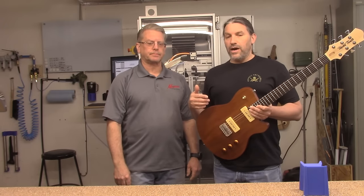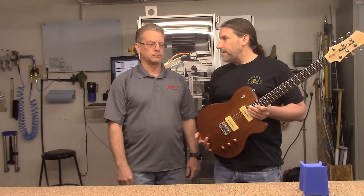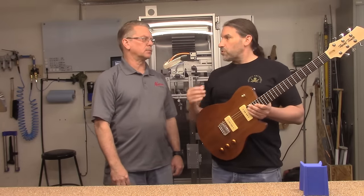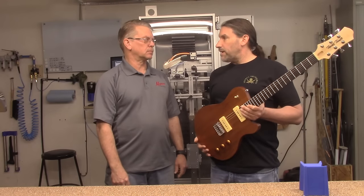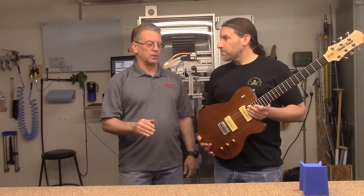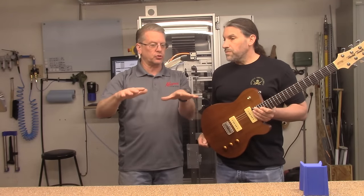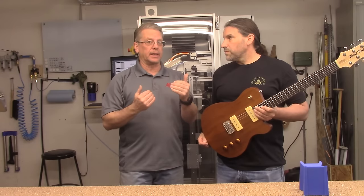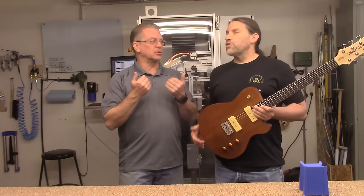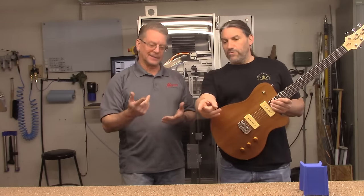But if you have a guitar neck that you want plecked, can someone just send you a neck and say, hey Steve, plek it for me? Or if Ike at Flipside Music, the great American guitar store, took a bunch of necks in there, how would that work? Yes and no. It is possible, but everything the PLEK machine does to the neck is done by calculating all the specifications under string tension. So you can't just send a neck in.